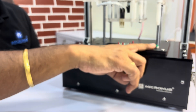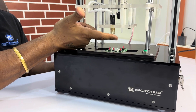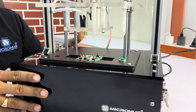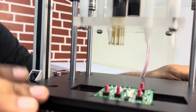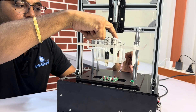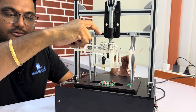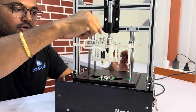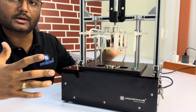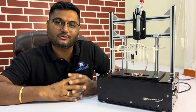When the clamp is pressed, 230-volt pins are live — and I am also demonstrating the safety here. This type of safety feature we are giving in lots of fixtures. Now for the push button, we press these particular points, so the push button is automatically pressed. It is very easy for the user — they do not need to insert their hands into the fixture from the top. Easily the user can do that part.